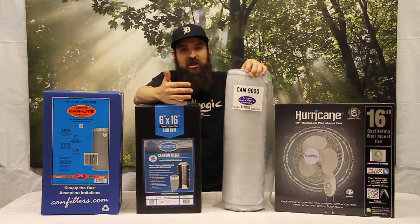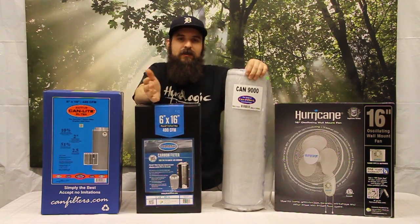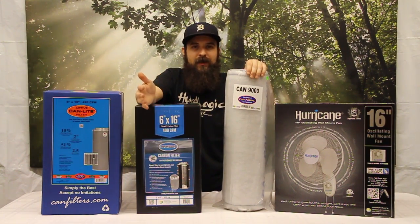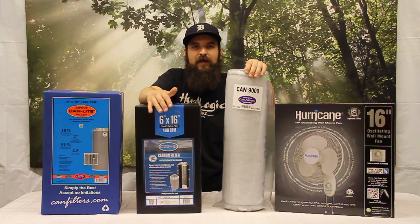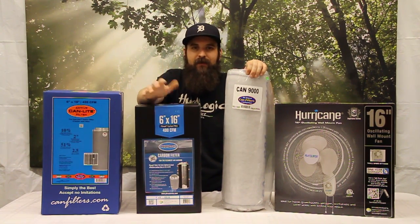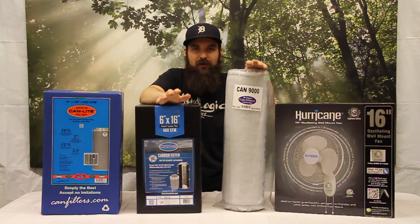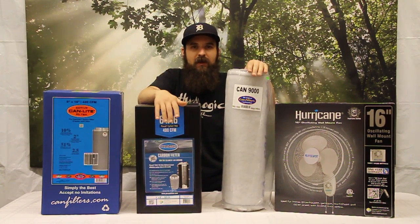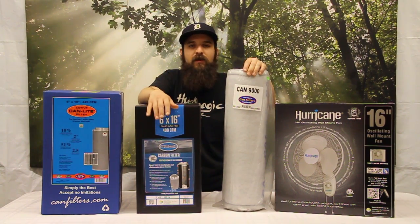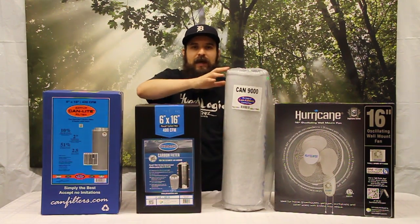Longevity is dependent on how they're used, how long they're used, and what capacity they're used. How to size one for your room is a question we get asked a ton and it's pretty simple. You want to figure out the amount of air you're trying to move by calculating your air exchange rate — basically your cubic feet multiplied by three to five depending on how much you want to move. Once you have that number, let's say it's 500 CFM, find the filter that comes closest to that number and match it with a fan closest to that number. You can go 150 to 200 CFM either way, but if you get closer to 300 to 500 either way, you'll start causing issues with how the filter works — it'll only pull in on certain parts of the filter and just won't work optimally.